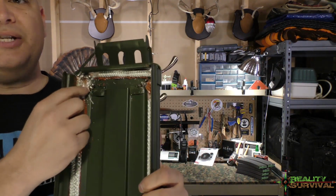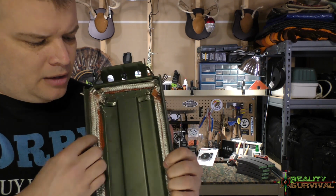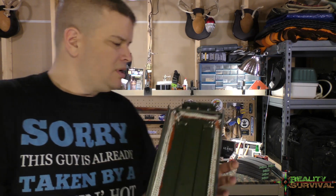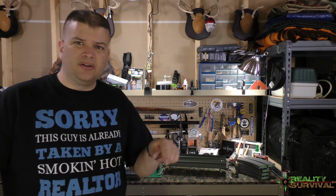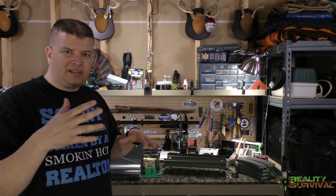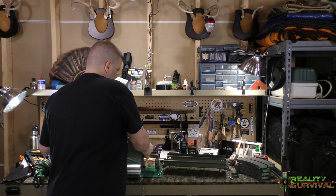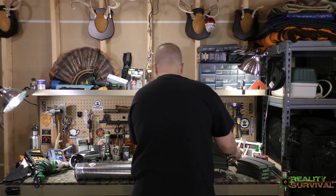And this is the inside here. I just used wing nuts in case I want to take those off in the field. I can do that fairly easily. I also took some fiberglass roping and some high temperature silicone and put that around the edges so that it still seals up well. When it comes out of the factory, there's a rubber ring that goes around there, and you've got to pull that out. If you don't put in some substance like the fiberglass roping, then the box doesn't seal up. It'll kind of rattle. But when you do it like this, it'll seal up pretty good.